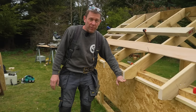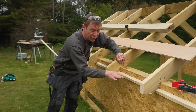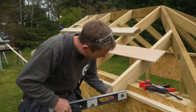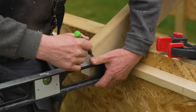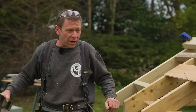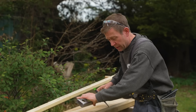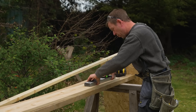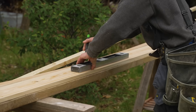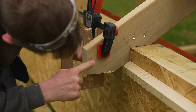Now you've got all the feet cut off and the plumb cuts done to take our fascia and soffit. On this one we've got a batten nailed there — it could be a different scenario, it could be brickwork with the soffit sitting on top. I'm going to get my level, keep it at the bottom of the batten, level it out, and just do a little reference line at the top — one there, one there, and one at the end. Because I've come from the top of the batten, that is the top side of the soffit. So on the fascia I keep it level with the top of the groove and draw a line, then put my fascia brackets on to hold them. That's our level datum line.